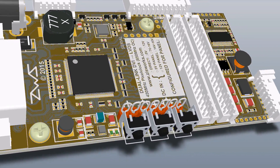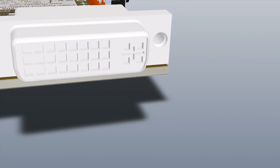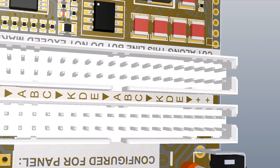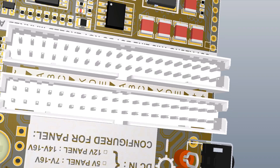Hi, I'm here today to show you an interesting board available for pre-order. The board is a raw converter from DVI to LVDS. It does not scale the image or resample the colors. It does no processing and adds no real input lag, only a few microseconds in line buffer mode.